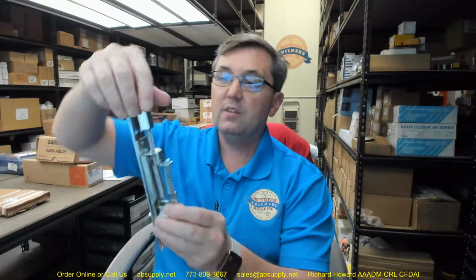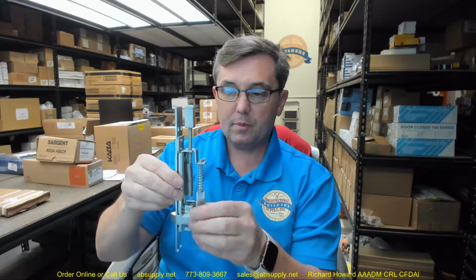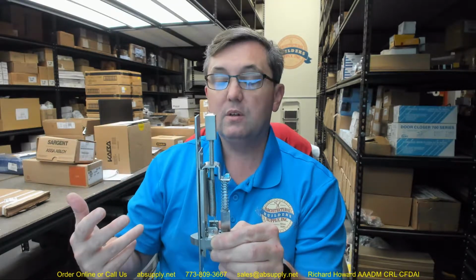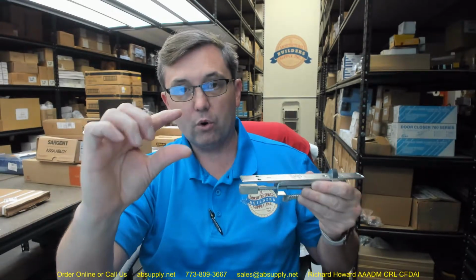This would have a rod that would go 12 inches from the center up to the top or the bottom of the door. This bolt head would then be elongated. The way that you would machine this for a wood door would not be conducive to the fact that you would need to drill a really long hole 3/4 or so an inch away from the edge of the door, and do so without rupturing out the edge of the door.